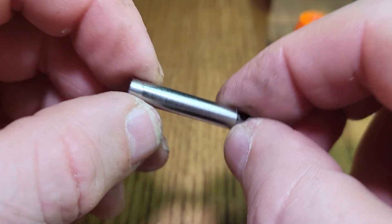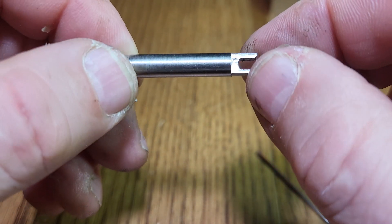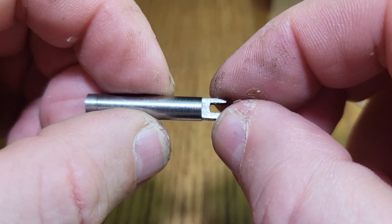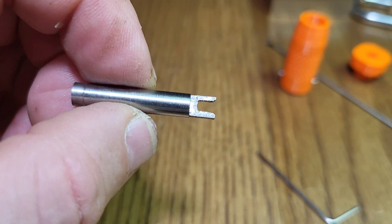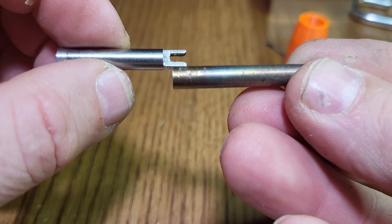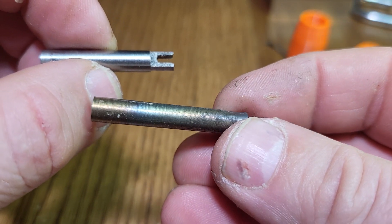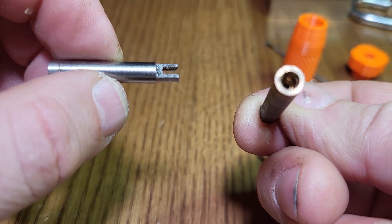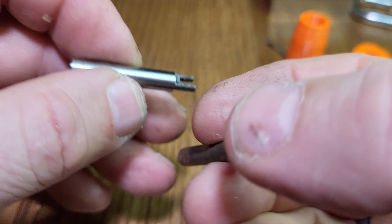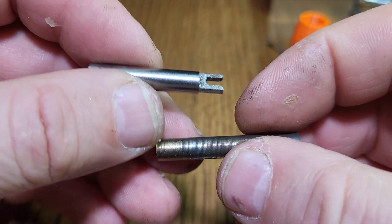If you try and drill a 1.5 millimeter hole through the center of a piece of stainless bar on a lathe, even with coolant, that thing gets hot. I went too fast and when you go too fast on a lathe, sadness results. This is the first piece I made - it heated up and eventually my bit snapped right in there, just wrecked it. There was quite a lot of work in that because I'd already turned down the stainless bar.